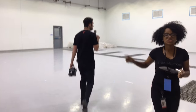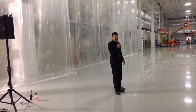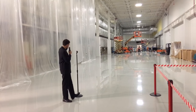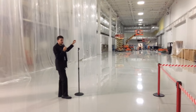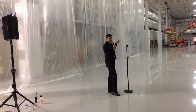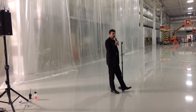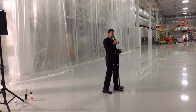The mixing machine actually starts on the solvent to make a slurry. We do that and pump it all the way down to the other end of this room, where it enters this massive oven. So we bring in rolls of aluminum foil, unroll them at the far end, and also at the far end is a coating booth. In a process kind of similar to a printing press, we lay a very thin layer of that wet slurry on top of the metal.